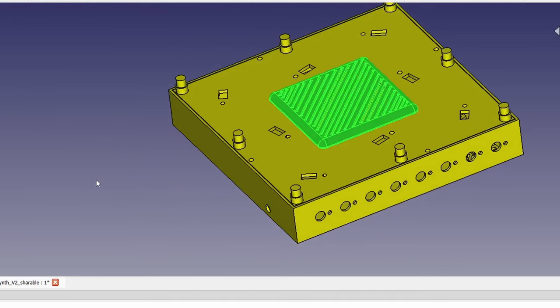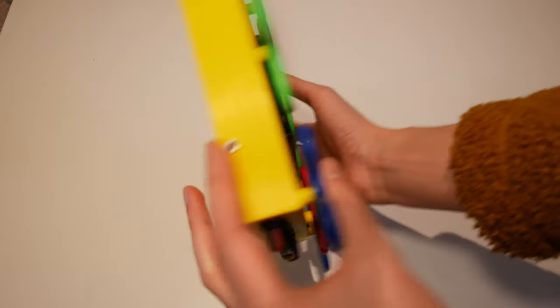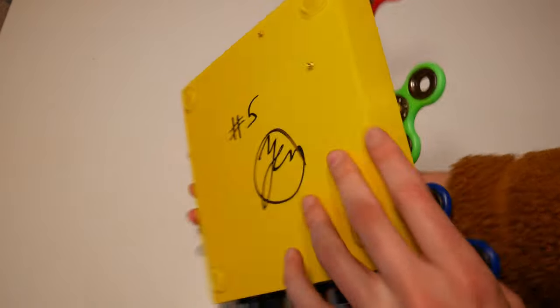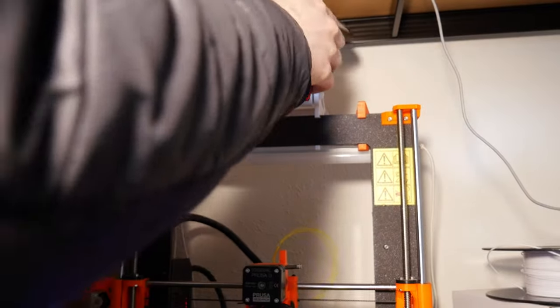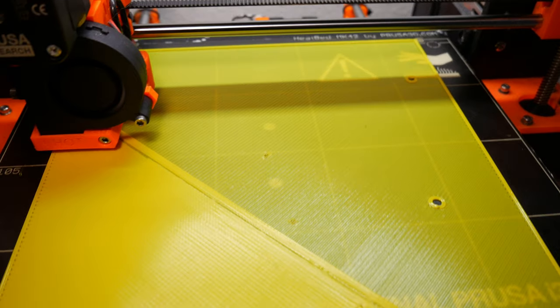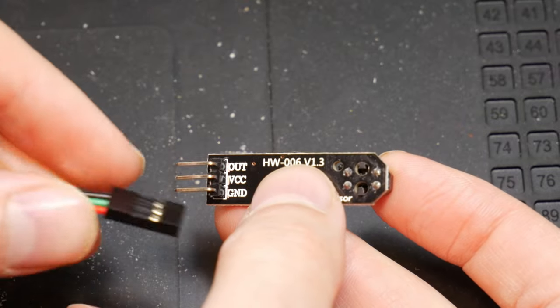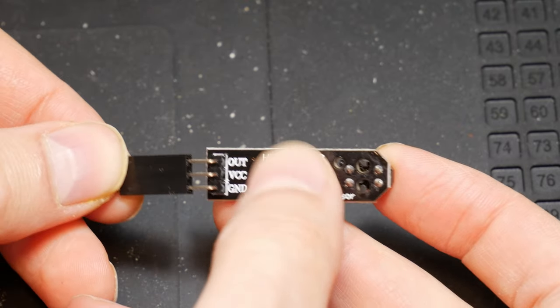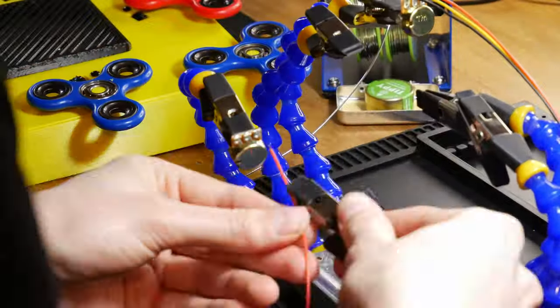From this point I numbered the frames. The first frame was super sturdy but took a huge amount of filament, so I slimmed it down for the next version and designed a closed lid. Serial 001 had small issues — mostly tolerances not exactly right. Serial 2 was almost perfect, and Serials 3, 4, and 5 are my final designs. This took a lot of filament and I had to switch the spool mid-print, accidentally missing the extruder insert — so we're missing one line in that print. I tried to keep the electronics as simple as possible. I don't like soldering, so I used standard connectors where possible, but I couldn't find anything for the potentiometer and ended up soldering quite a lot anyway.